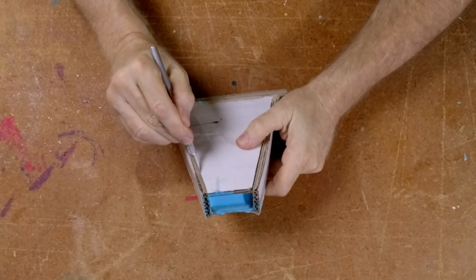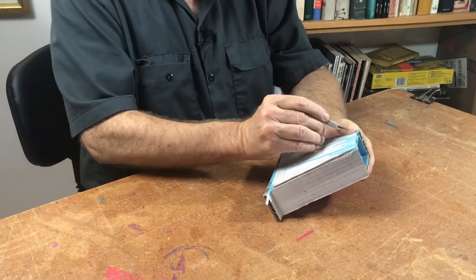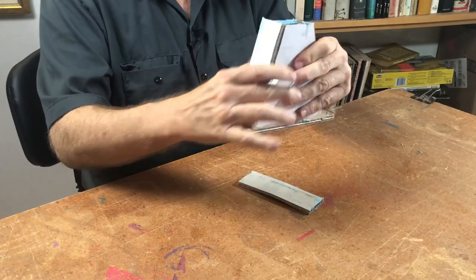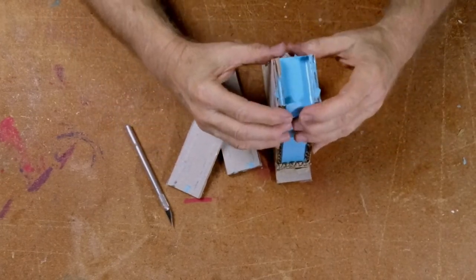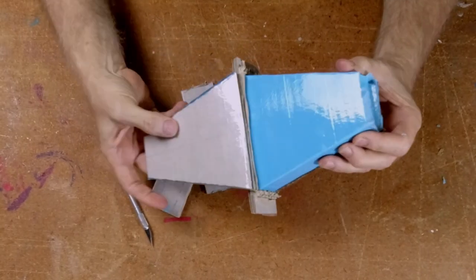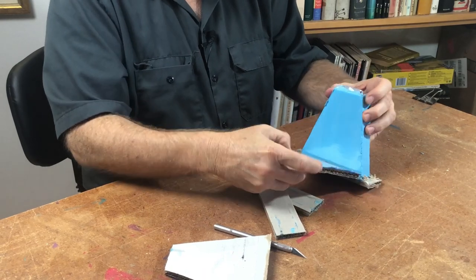It's the next day and it's time to cut the mold. Start by trimming off the tape a little bit. I took the paper off the table because I don't like cutting open molds with paper on the table — makes it harder. This is why I like sticky wax compared to hot melt glue: see how that just popped off? It's such a breeze to take molds apart. They bond together great but come apart easy.